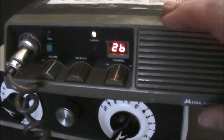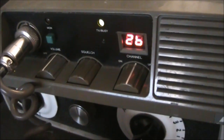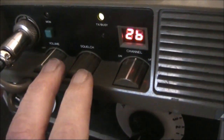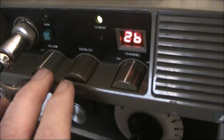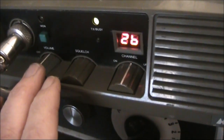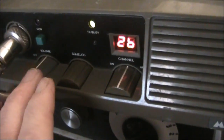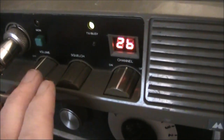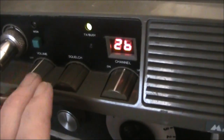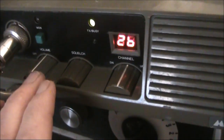And definitely better. Not quite as good as the FT817, as the Midland is less sensitive, but there's still a good improvement in readability, from being only just detectable to being readable signals. This is despite me using RG213 coax for the diamond and two sections of RG58 patched together for the feed line to the vertical extended zepp. So if I was to use the vertical extended zepp and RG213, signals would likely be better again.